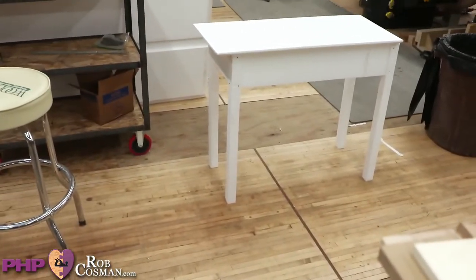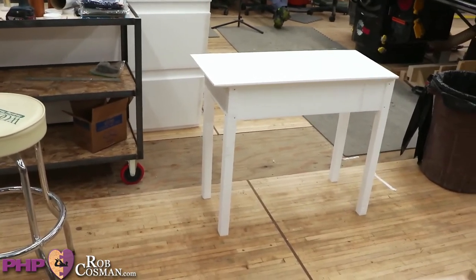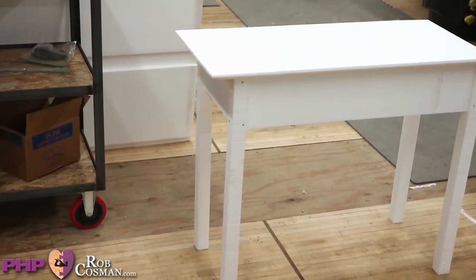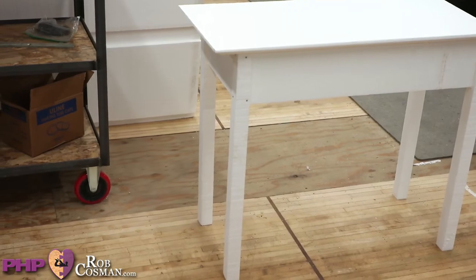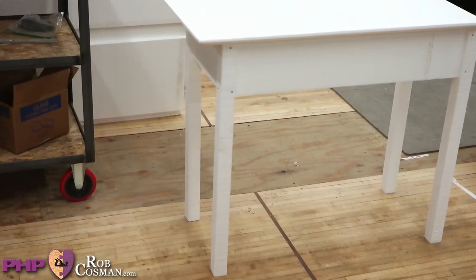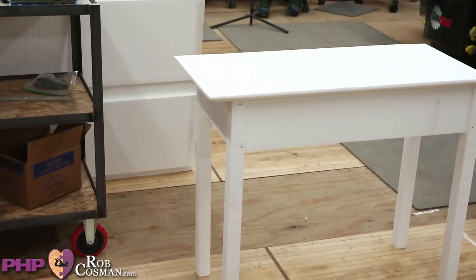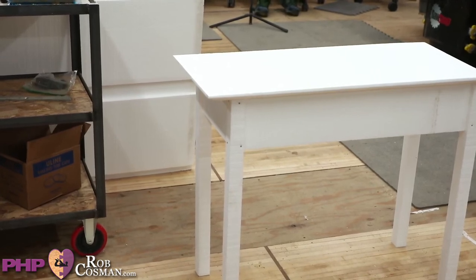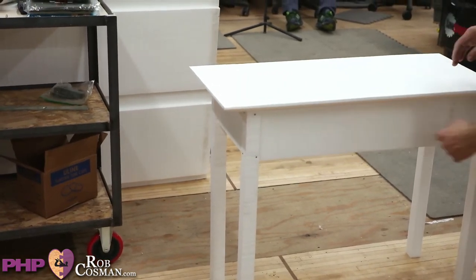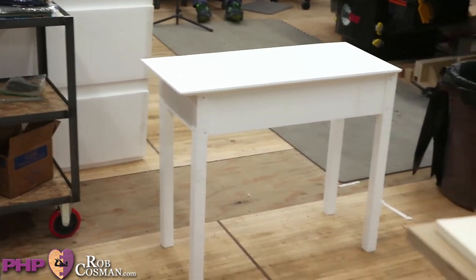So just now, ignore this end. Obviously, just focusing on that end. Are we getting anywhere? What about the leg? Does the leg need taper or does the square leg fit? If everything is rectilinear, which is what this is, although we did introduce a bevel on the underside of the table, then you kind of have to stay with it. You can't mix a lot of curves with rectangular pieces and have it look right. At one point I thought we could put an arc in here, but then that really wouldn't fit unless we did that somewhere else.